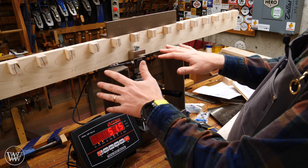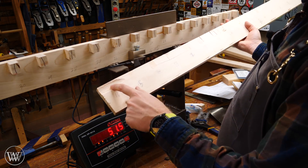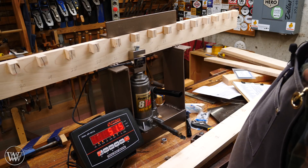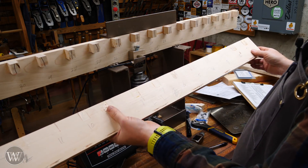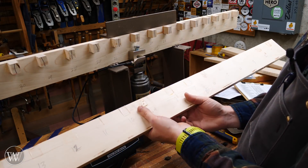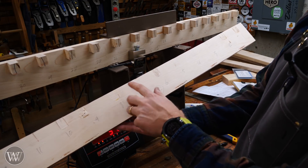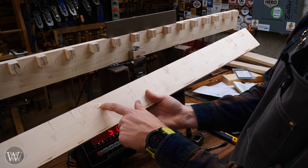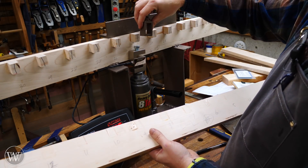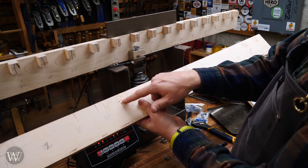Some people will say that some boards are weaker than others, and that may cause variance in my measurements — and that's what I'm finding. What I've done is spread out all of the glue tests so that on each board I have one of every glue test. What I'm finding in my preliminary tests — these are test boards just to test the apparatus — is that probably around 65 to 75% of the time the glue is completely shearing off, with only occasional cases where the wood shears. In those cases it's usually because I don't have the frame on tight enough.